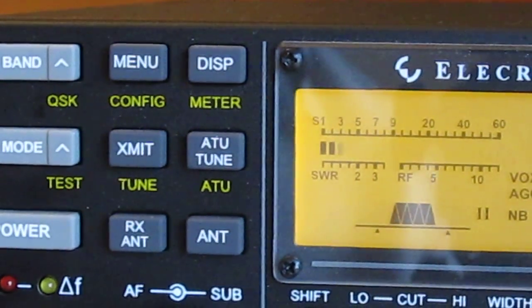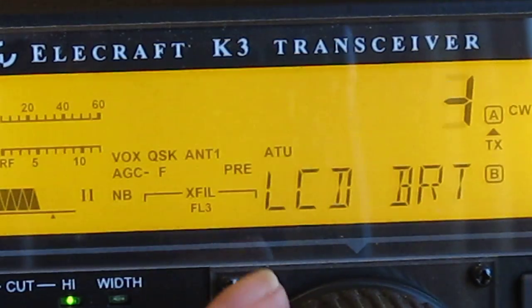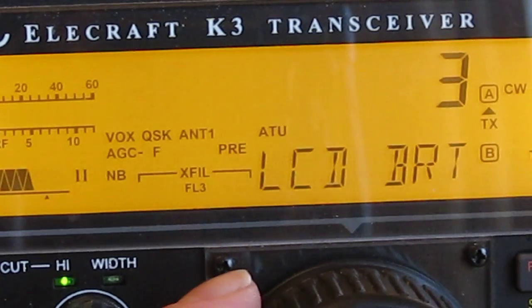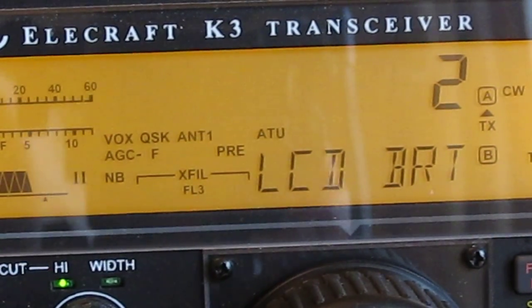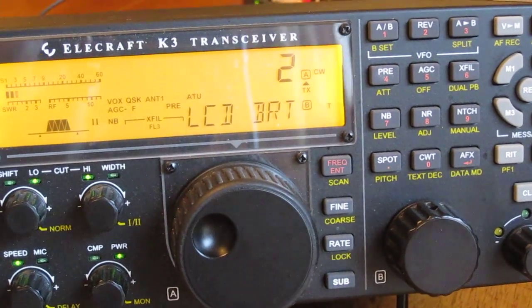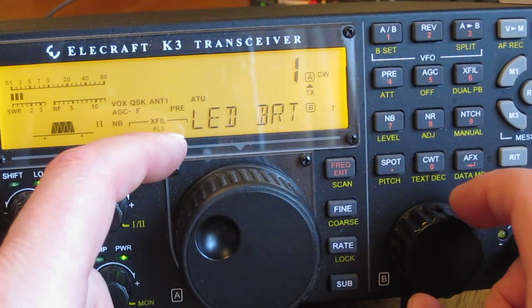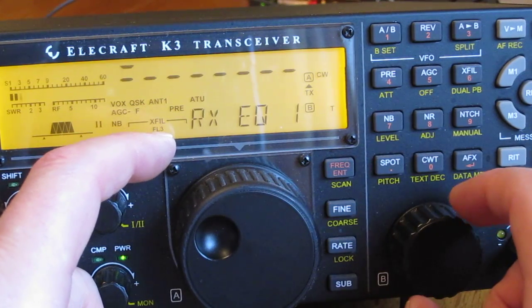On the other side you have the menu. Tap menu to enter the main menu, where you can check LCD brightness and increase it using VFO A — the large front knob. I'd leave it on generally 2 or 3, which is enough. Using VFO B, you can scroll through functions: LCD display, LED brightness, mic selection, line out, message repeat, and all sorts of other functions.